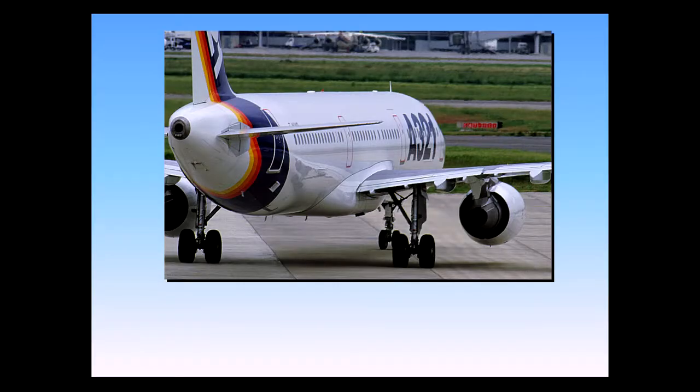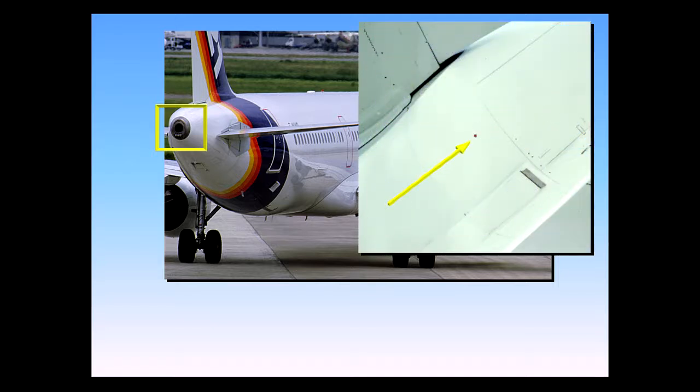During the walk-around inspection, you must check that the APU exhaust is clear and verify that the APU fire extinguisher overpressure red disc is in place. For more details on this red disc, refer to the fire chapter.